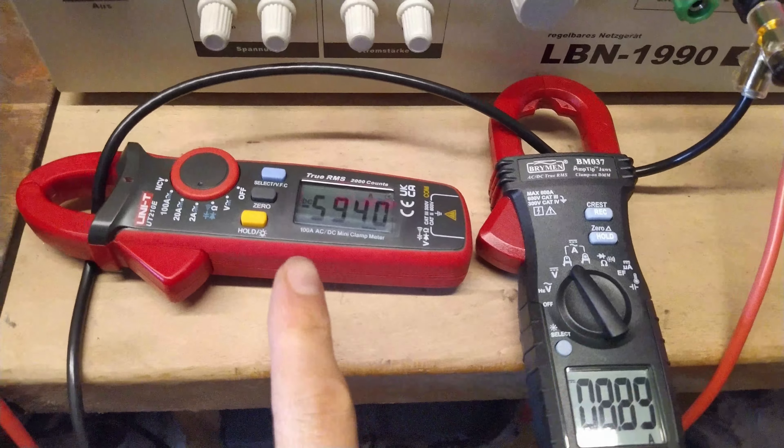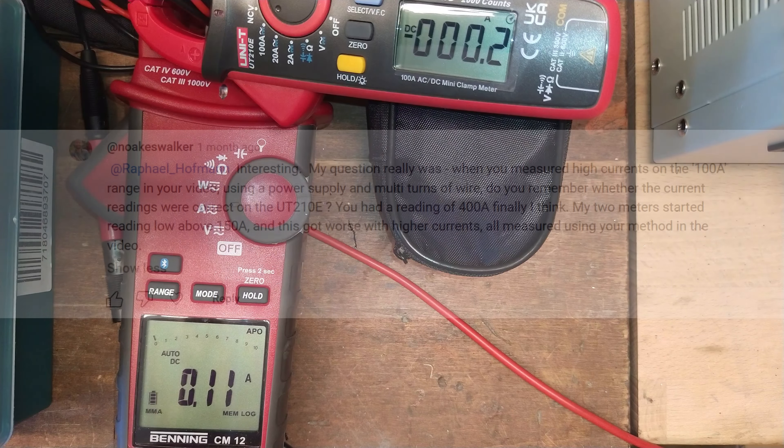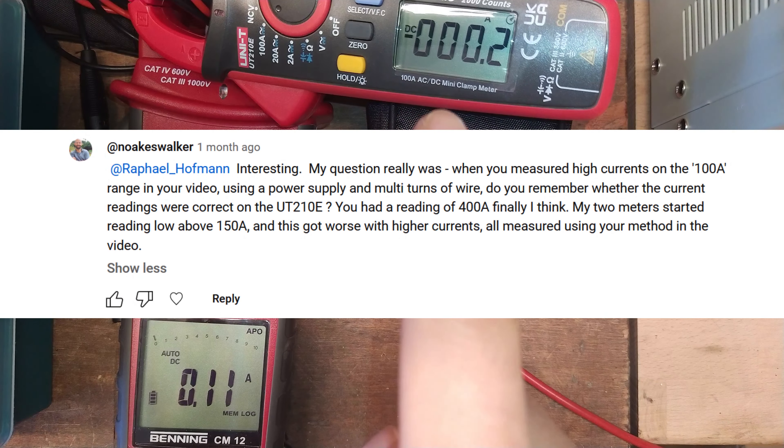Sometimes in one direction, measuring the current is absolutely wrong, but taking it the other way round it shows correct values. When you're measuring currents with PWM frequencies above 6,000 count, you might run into instabilities where it only displays 6 amps but the actual current is 9 amps. The 6,000 count mode is the safest, and above that it's more experimental. If you don't work with PWM frequencies or noisy power supplies, it's no issue and you can apply 8,000, 9,000, or 10,000 count mode.